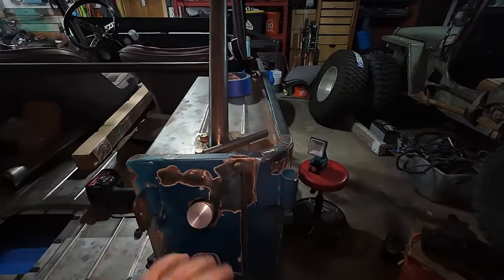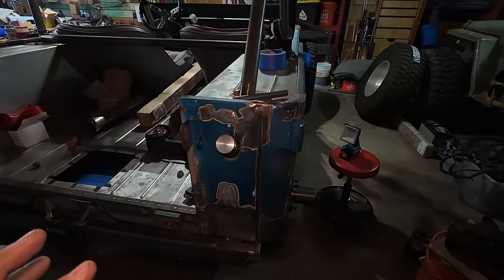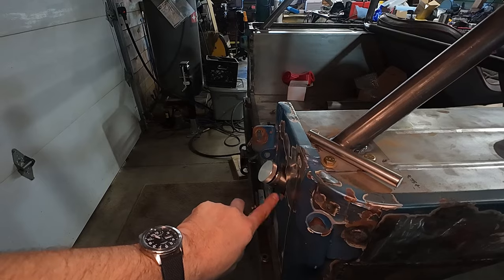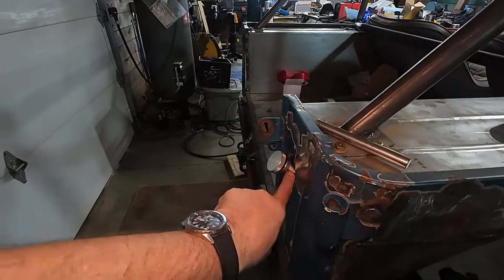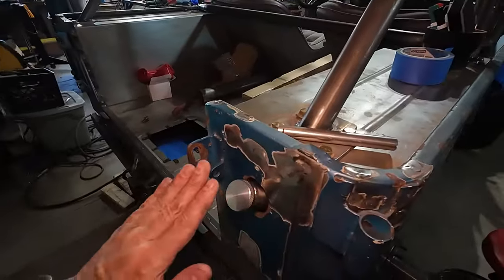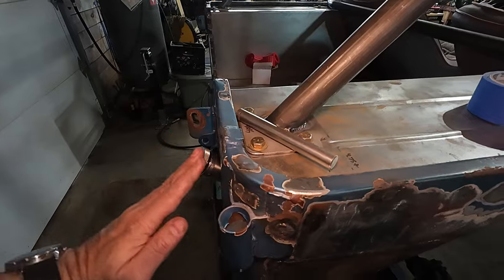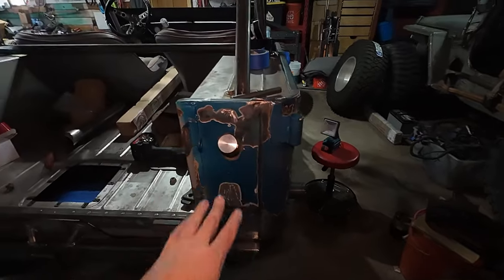This is still a little long, I think. It's hard when you're mocking things up to hold three things at once. This is actually stainless, so I couldn't really find a good way to hold it in there, so I decided to leave it just a little long. Before it gets final welded I'll cut this back and flush this cap down — I think I have about a quarter of an inch I can sink it in.